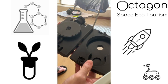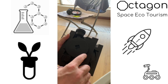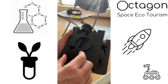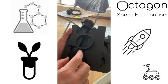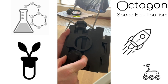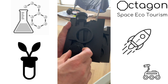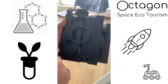Here's what we have. I've obviously made some mistakes that I had to cut out. But again, this is version 1. And here we have the big gear that I was telling you about. If I take that off right away, we can see here that we've got a crank and a crank arm that comes around. Looking online at how this whole thing needs to work, the length of this arm versus this diameter has obviously got to be bigger than 1:1, or else this angle is going to be less than 45 degrees and we'll probably get into trouble. They recommend anything from a 5:1 to an 8:1, and I'm more along the lines of an 8:1.